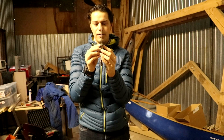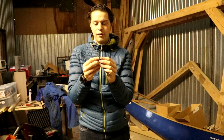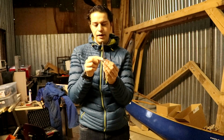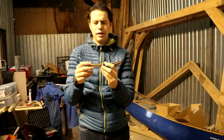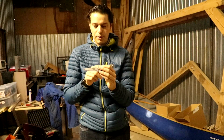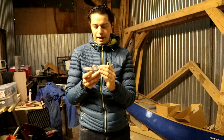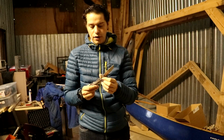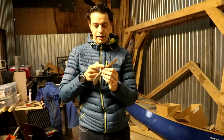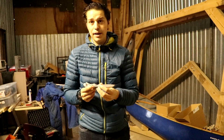Normally I would fix this right away, but I decided to fix it after heat treatment. That way I hope I will be able to reduce the residue. You always have some residue from heat treatment, and if you polish the lock face with Scotch-Brite afterwards, it will be smoother and better. And if I remove too much material now, then I might get too late lockup later in the stage. So next step for me: finish the contouring and start finishing the entire blade.